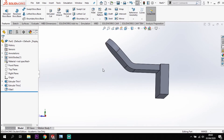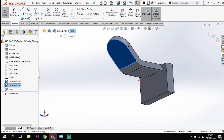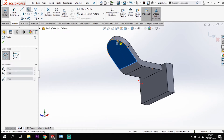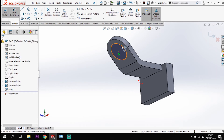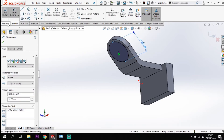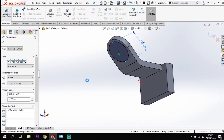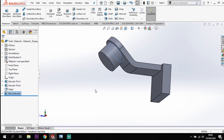What we need to now do is add this shaft in. I'm going to click on that face and sketch, and add a circle in here. Hovering over the outside edge of the circle will bring up the center of the circle - if I click in there and drag out, that just allows me to line the two circles up with each other so they're concentric. The diameter of that circle is going to be 52. Then I'm going to extrude that out - features, extrude - and that's going to come out 32.